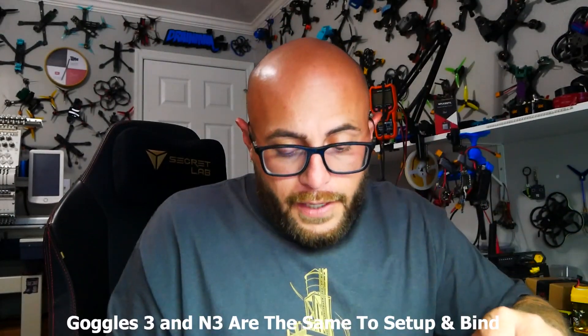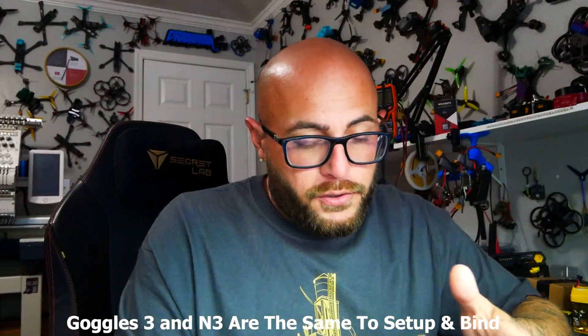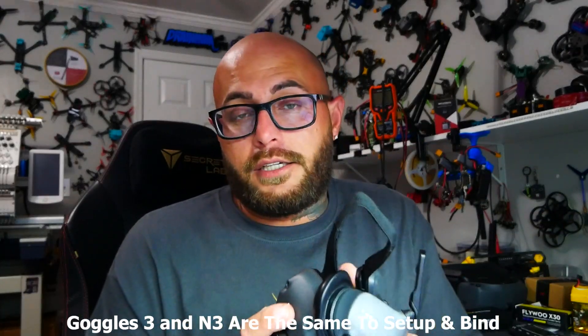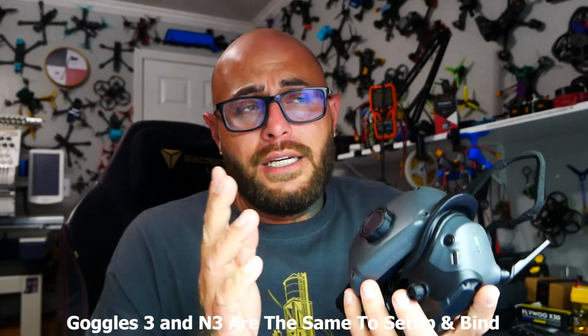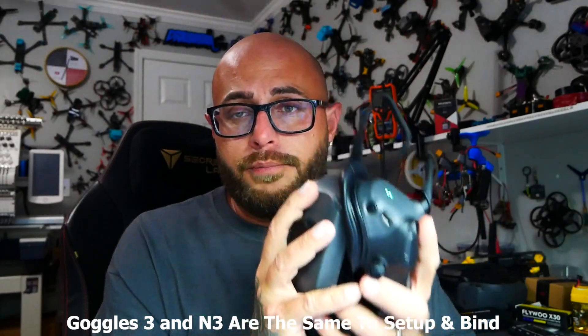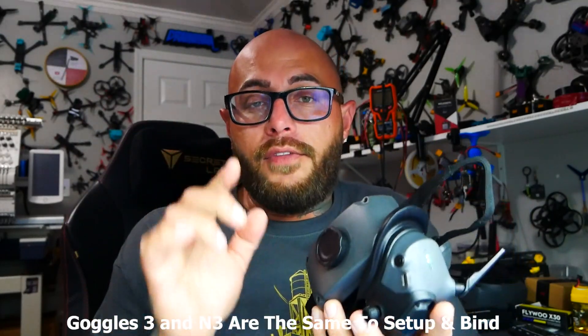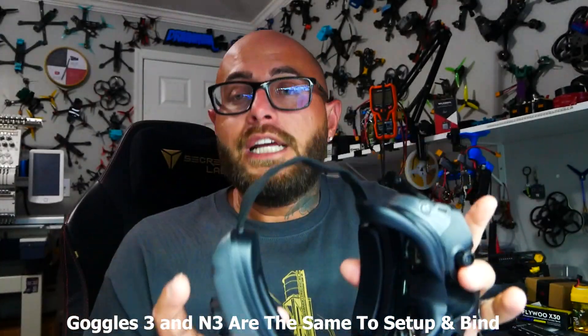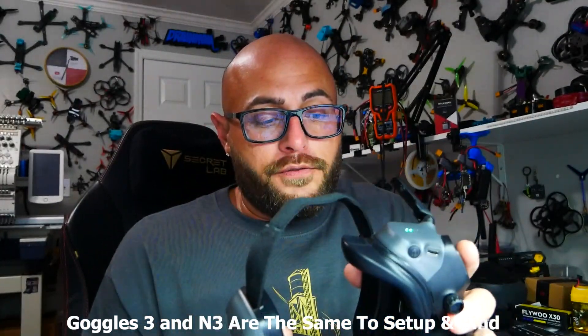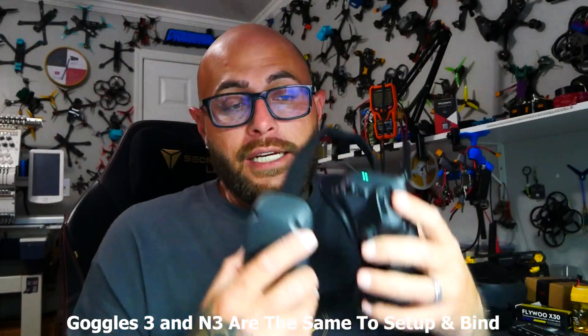Hopefully you won't have to do that — hopefully you'll have a plug just like both of these stacks here. If you have new goggles and have not activated them, this does not get done on the computer. You'll need to download the DJI Fly app — you should have a QR code when you bought these. Put that on your phone and then use a USB Type-C from phone to goggle to activate and update the firmware on your goggles. It's very important that you've done that, because the goggles — at least mine — did not come with the O4 option already on them. I had to do the update, and then DJI O4 became a possibility.